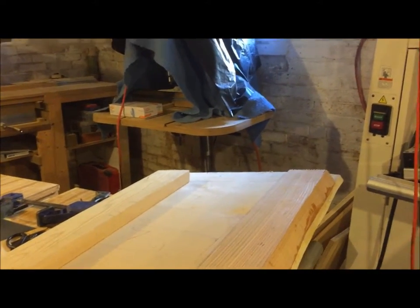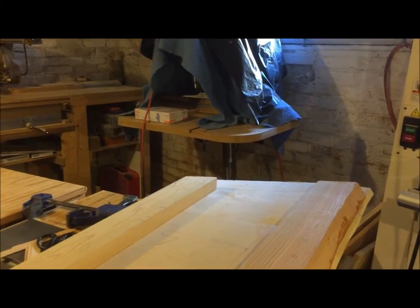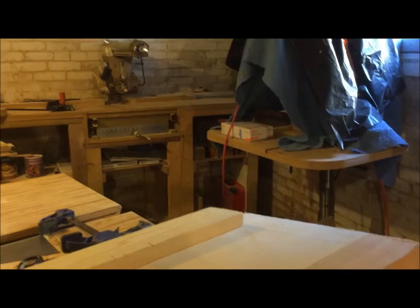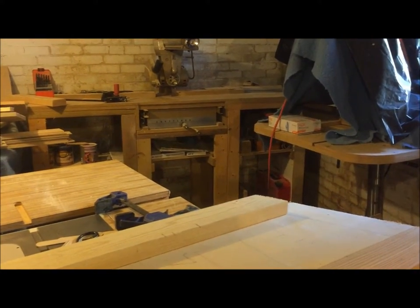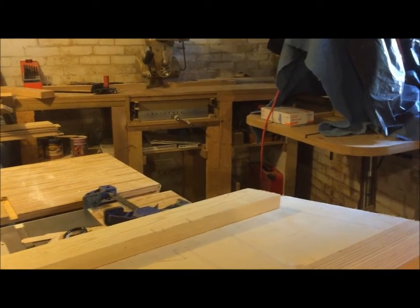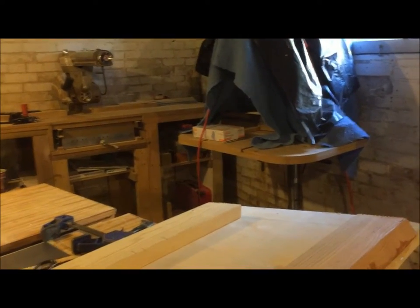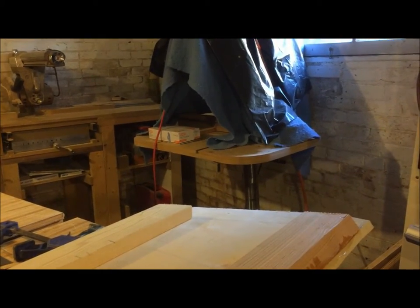On the dory when I built it, I used coated deck screws, which are perfectly fine — until you leave one a little too high and hit it with the sander, exposing the metal. On edges where I didn't glass over completely and just used thickened resin to cover it, I got a hairline crack and now have rust spots in a couple places along the shear clamp. Someday I'll sand that back down and run a layer of glass along the top to seal it back up.